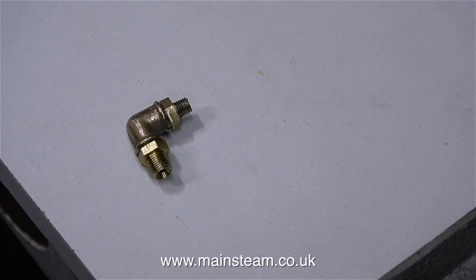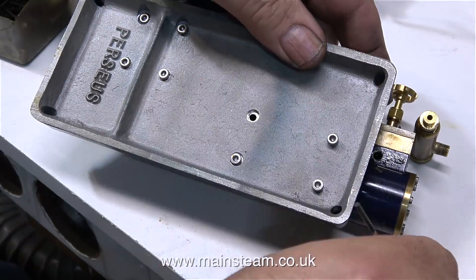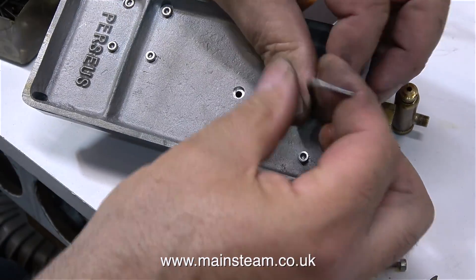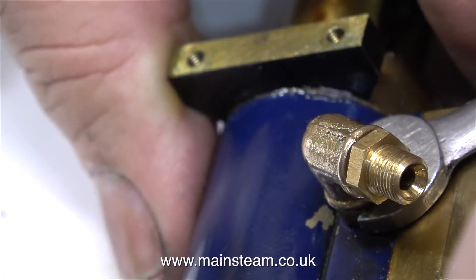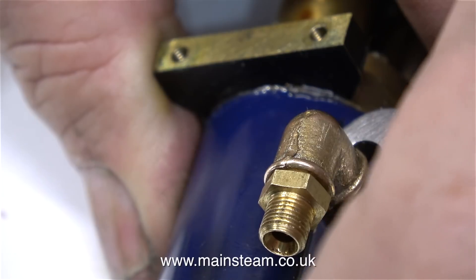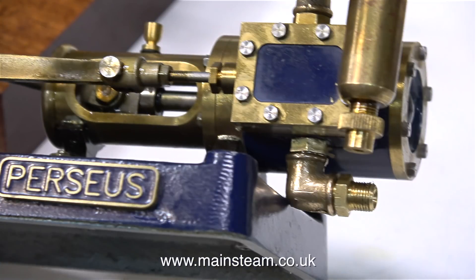This is my answer to the exhaust fitting for the Perseus — a PM Research 90 degree elbow, and I had to re-tap the thread to make it compatible with all my quarter by 40 fittings. This part of the job wasn't planned, but in order to fit the exhaust adapter to the engine it has to come apart. I just remove the cylinder from the bed plate, then with the help of some Loctite 542 and a copper shim washer, I rotate the part into the correct orientation. So now the engine has an exhaust outlet which is very easy to connect a pipe to and disconnect a pipe from.